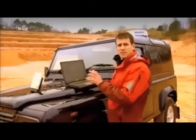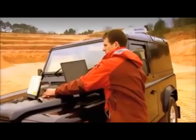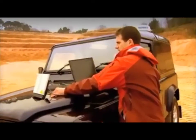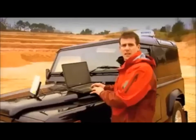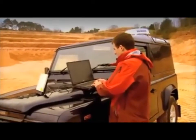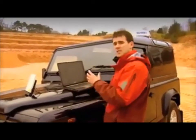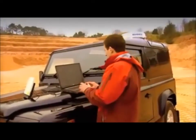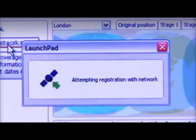I'm looking for a signal strength of at least 45, so I'm just going to move the terminal slightly to try and increase the strength of the signal. That's perfect — that should be more than enough to register with the network. I've just clicked on the pane, and we're trying to register with the network. This should take just a few seconds. A little icon has come up and it's attempting to register with the network — a little green arrow pointing at the satellite.